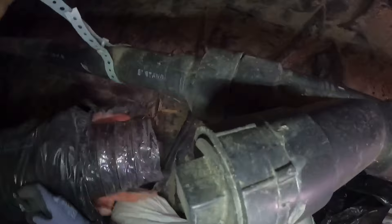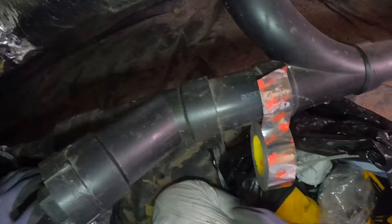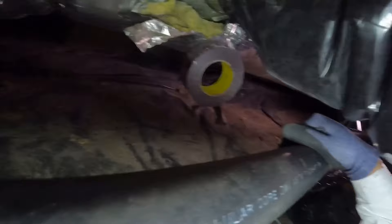I trimmed around the vent duct and shook out all the feces — make sure the line is clean before you install. I'm using 3M vent tape, and all the tools I use in this video I'll leave in the description. First I want to secure the connection temporarily, since it's such an exact fit I can't easily place a clamp without it falling. So I'm using the tape as a secondary hand to hold it temporarily while I use my zip tie — also called cable ties or tie wraps.